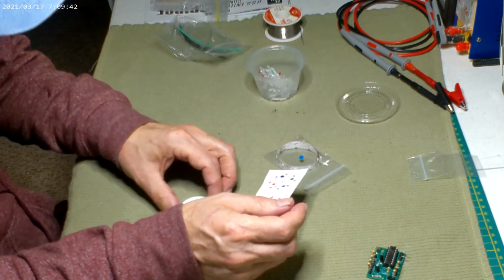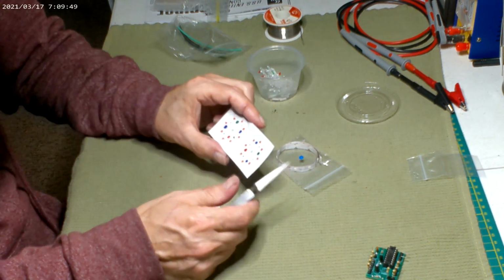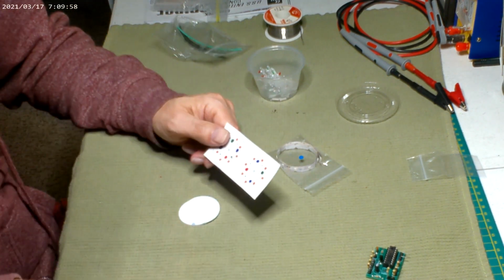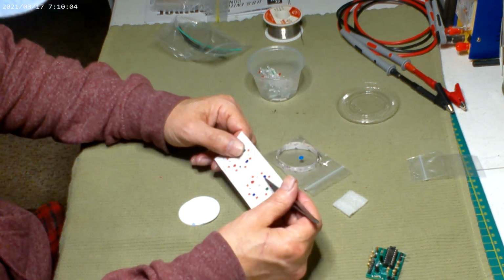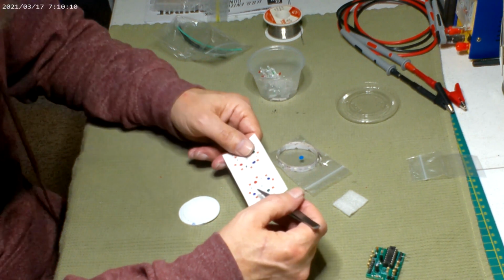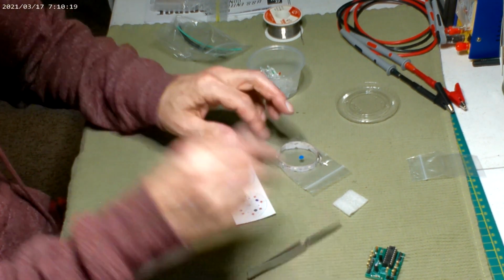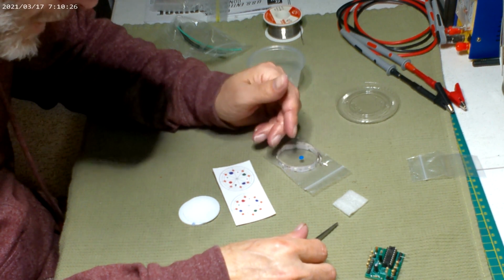But then I was thinking, I'm going to have plenty of room on these. We're just going to have these outer circles, which I have in orange here. So I could add more lights to this besides the ones spinning and have them flash, and give it those colors that you normally see, the blues and greens and reds. So I figured I'd use one flash SMD and have it control another one, just a regular SMD, so they'll flash at the same time, unless I use 5 flashing LEDs, which I could, and then they would all just do what they wanted to, which is an option. That would be kind of cool too.